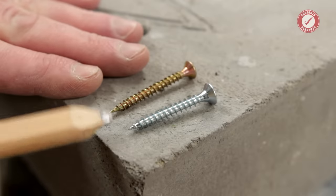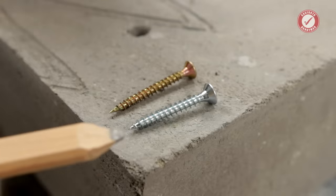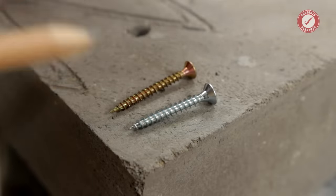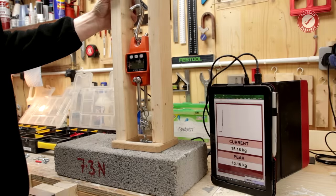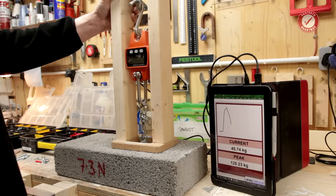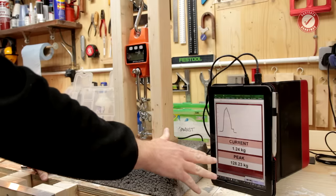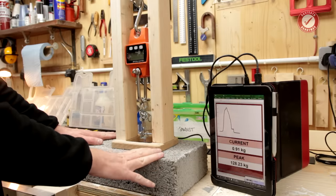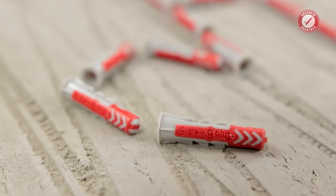Whatever we get on a pull load is your worst-case scenario. Bear in mind I'm going to be showing you peak values — I'm not taking into account the safety factor. Bare minimum: divide whatever figure I'm getting by three. Some manufacturers use much higher safety factors — I've covered that off on separate videos. I'm doing the 7.3 Newton concrete block first. I'm going to do each test three times — on the concrete block, on the thermalite block, and on the plasterboard. I'll come back once I've done all that, and I'll just take you through some technical information while showing you some pictures of wall plugs.